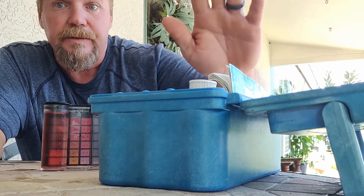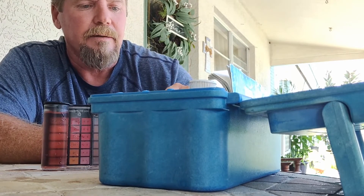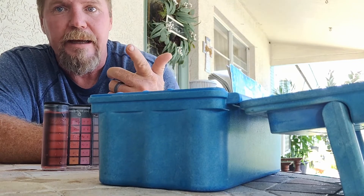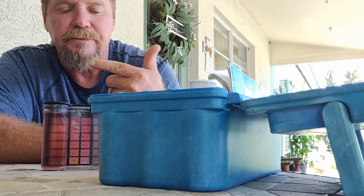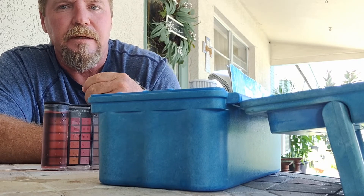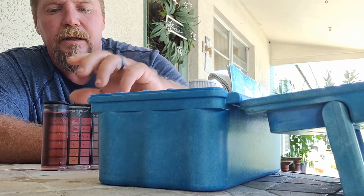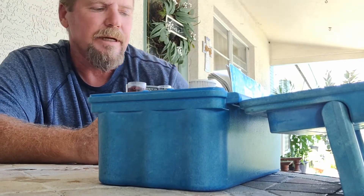You go into your book and see how much to decrease your pH using muriatic acid. Muriatic acid and dry acid are the best ways. Dry acid is going to be more expensive in the long run because you have to add more of the powder to get the same effect as muriatic acid. Follow that step, get done with your sample, and dump it out.